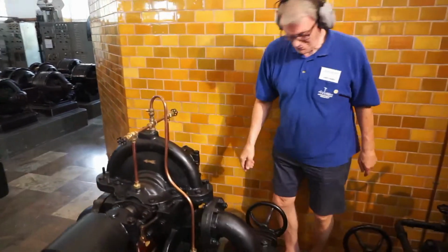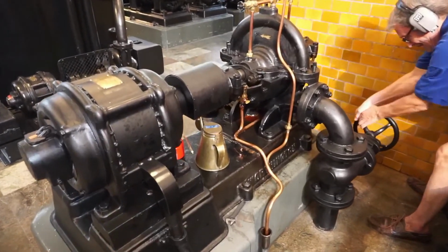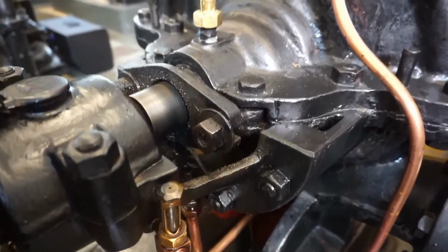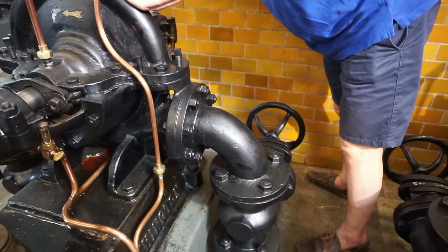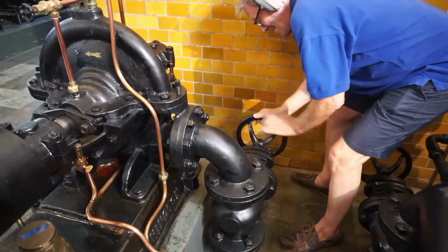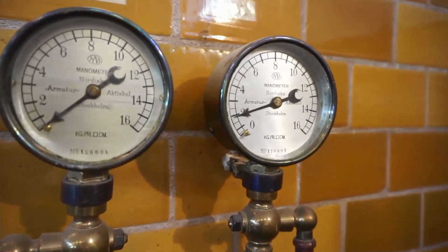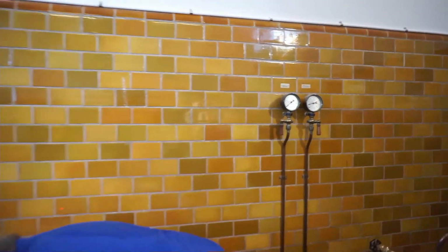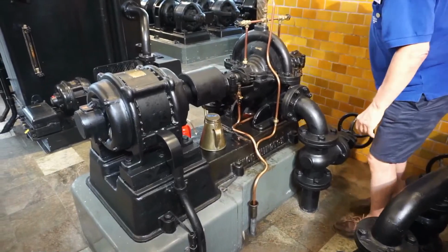And now he is opening a pressure valve to get cooling water out to the resistors and to the transmission unit. It's the hard work of today because he has to turn the valve 25 turns against the water pressure. The water pressure is slowly rising, which you can see on the manometer on the wall. Okay, the cooling system is running,